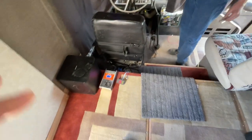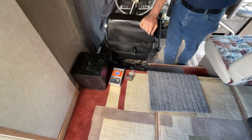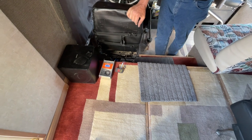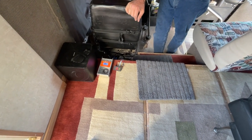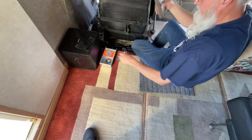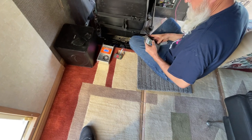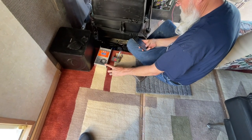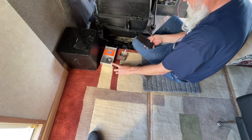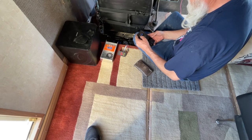I saw an interesting use of a solar charge controller to charge lead-acid batteries — it's essentially a DC-to-DC converter. You could use another one of these hundred-dollar units to do a three-stage charge on a lead-acid, which I thought was pretty cool. This one's wireless too — it has Wi-Fi, though you have to get onto its network to use it.